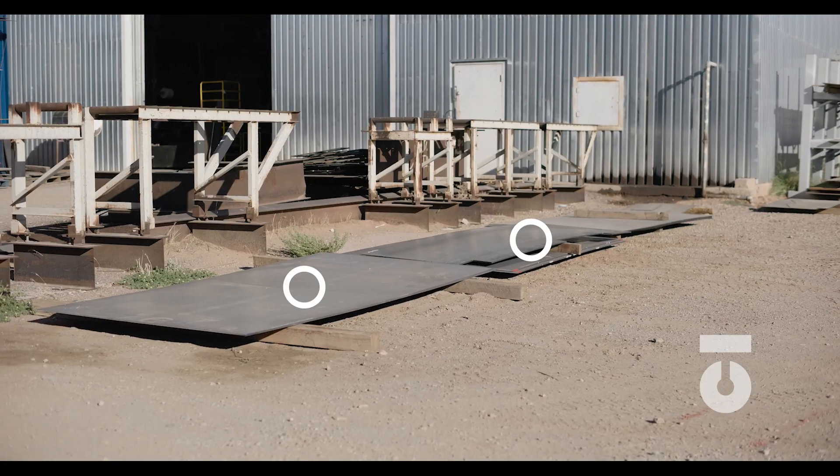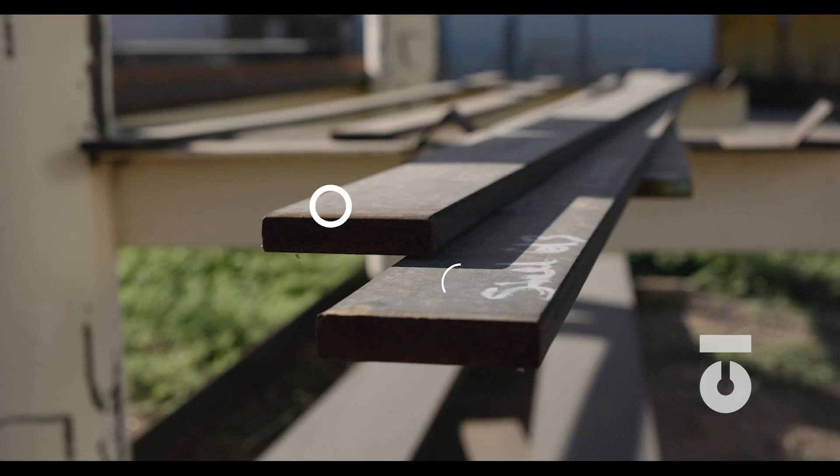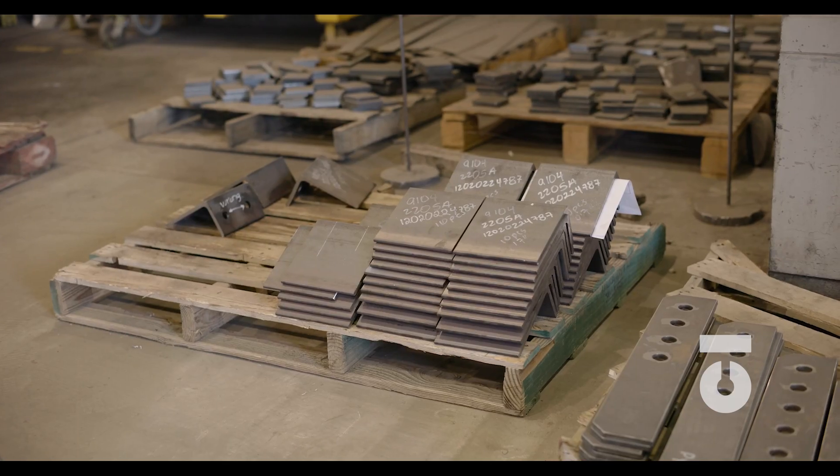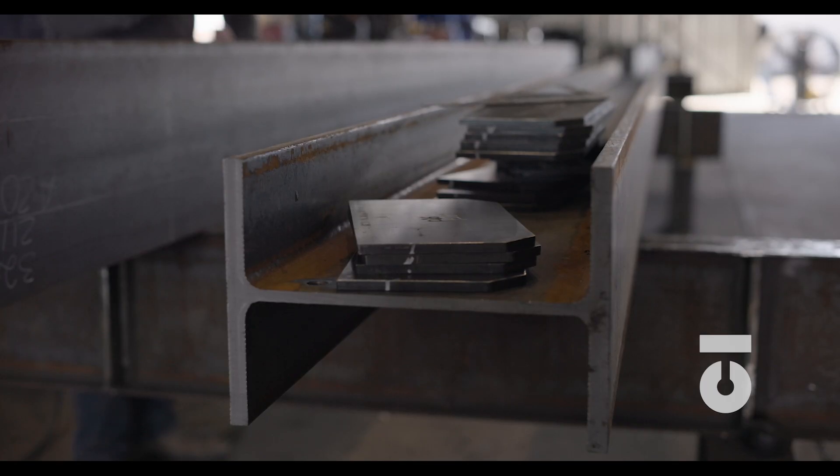Cutting parts. Parts, like our steel members, will be cut from nested material specifically purchased for the job. Most parts that are cut and created will be welded onto beams, columns, and supports alike. They could be base plates, top plates, connection plates, clips, and more.